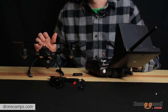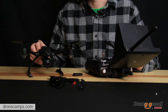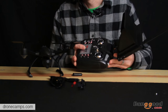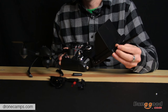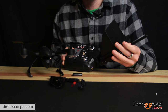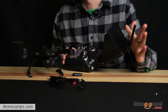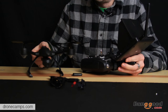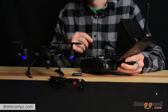We'll go outside and do a test flight and give you our opinion on the flight. I have the camera down at bench level now so you can see the LEDs on the bottom of the drone when we power it up. I did plug in the battery after I got it fully charged. I charged up the monitor long enough so that I think it will probably work. One thing you want to make sure is that you screw the antenna on before you turn on the monitor — very important, because that could burn out the video receiver inside the monitor.